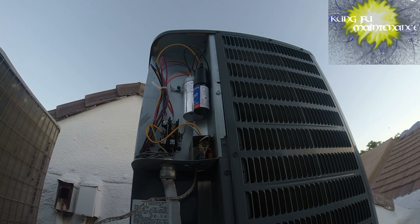The compressor — it's been about five minutes, which is good. If I was too fast, I might want to wait until it's had five minutes for the pressures to equalize. We don't want the compressor to try to start in an unequalized state — then it might blow a fuse or trip the breaker. We'll go ahead and be ready to see how we start.